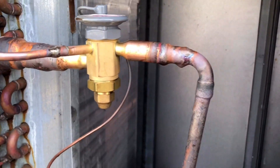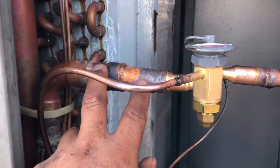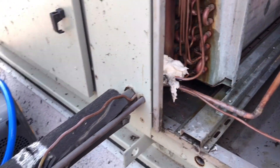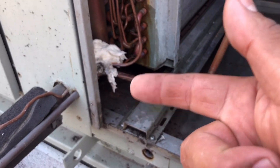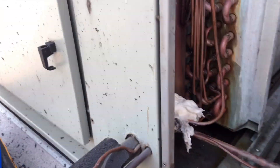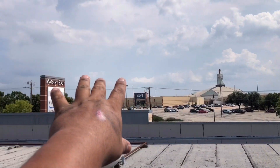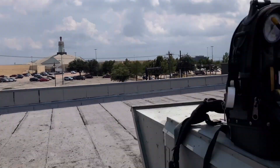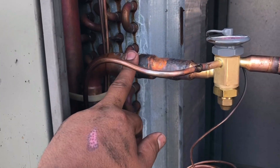I didn't get too much video of the brazing, but you guys know how it goes — braze here, braze here, braze here. I did the equalizing tube down to the suction line, just finished that. What you do is pressurize your system to about 60 psi and then start drilling with a little drill bit and it'll push all those shavings out. The weather went north so I got lucky, but I had to hurry up. We got the valve sweated in already.